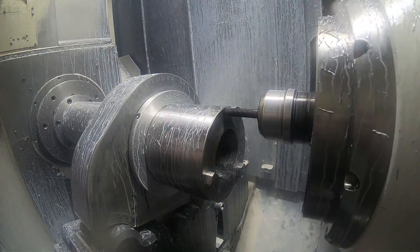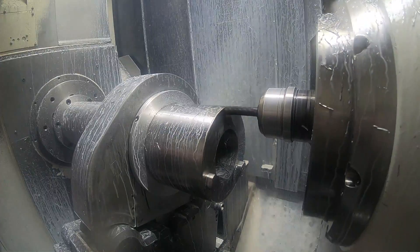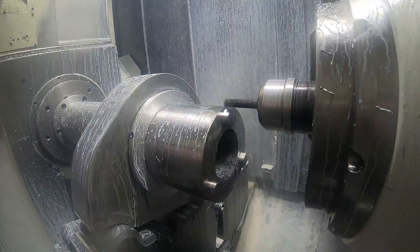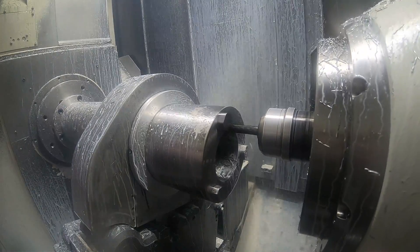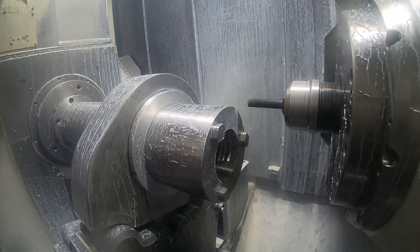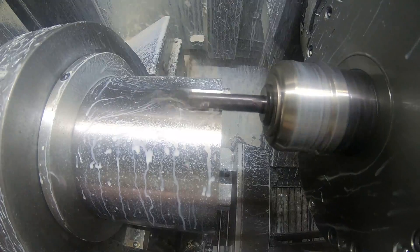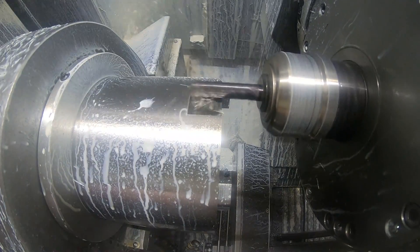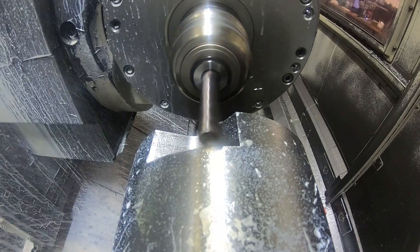This is just machining these three diamond pin-like things that mate to the part — the bores in the three parts on the tube. Right now it's just roughing them off and it's going to rough further back in there. I'm showing this adaptive cycle, but I don't really use it consistently — it's not really the fastest way to rough off material.